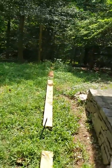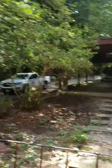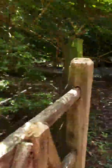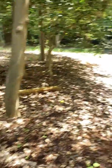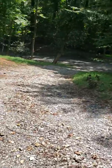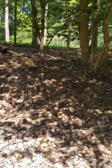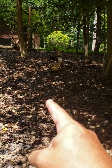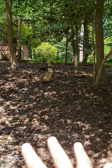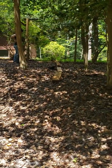It is 48 feet to that fence and then we have two options depending on grade. Plan A will be to take it as the boards are laid and bring it down here. The one thing I'm concerned about is washing out on the driveway, because it has already done it a little bit in these big rainstorms. It is 66 feet to about right here, so we could come down here, put a drain, put some riprap rock down here and let it disperse. It'll slow things down and hopefully slow the erosion.